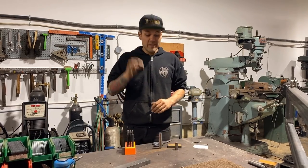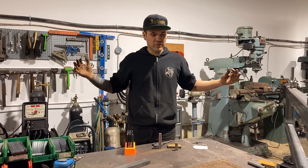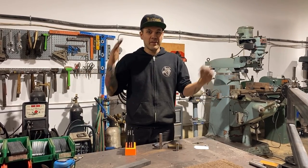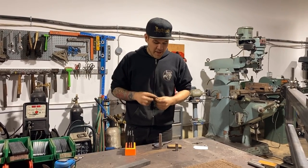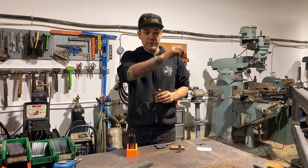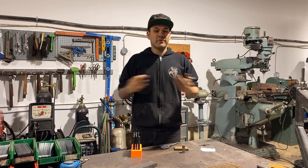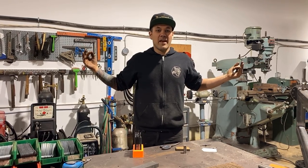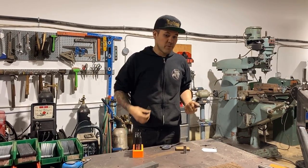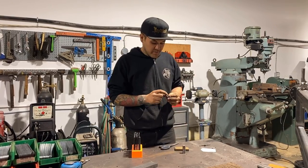So this tool is amazing for that, because you can just do your whole panel, it'll be warpy as hell, and then you dimple die these little recesses for your screws to attach it, and that shrinks the frame until it's totally flat. And the first time I saw that was when I was doing my door panels, and it blew my mind. So hopefully it kind of makes you think a little bit.